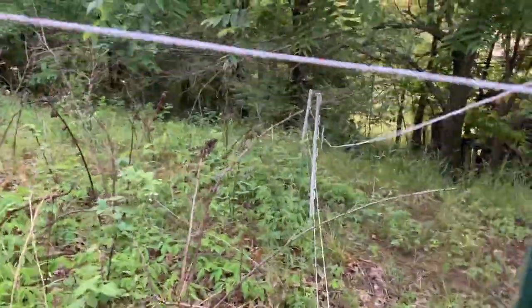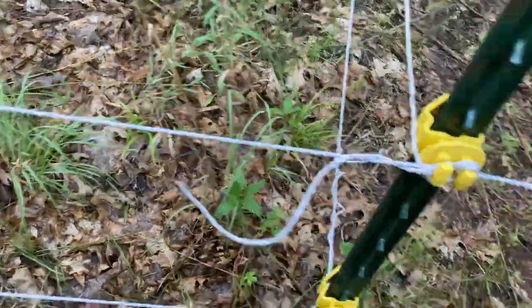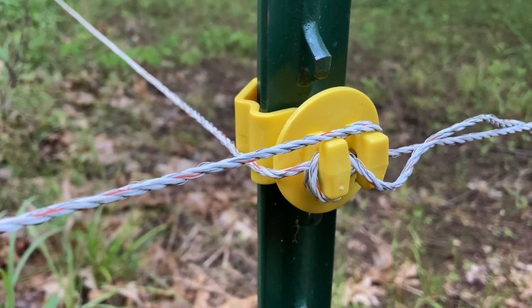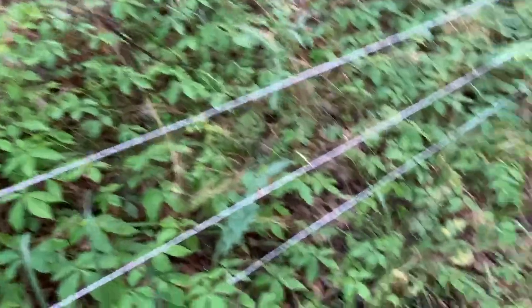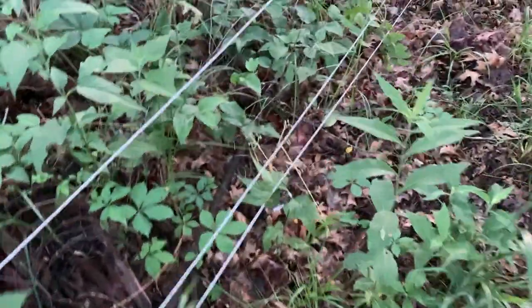First step is to reconnect the fence. You want to make sure you get it nice and around the insulator — not touching the metal part of the fence, because if it touches the metal it's going to short out and your fence won't have any charge. There are probably better insulators for this job, but this is what we have on hand, so you just have to watch carefully. Now we're going to walk the fence line and look for any debris that's fallen on it or anywhere it's been knocked over. It definitely needs to be trimmed with the weed eater around the bottom, but I just don't have time for that today — we'll remove any large obstructions and reconnect anywhere the fence is down.